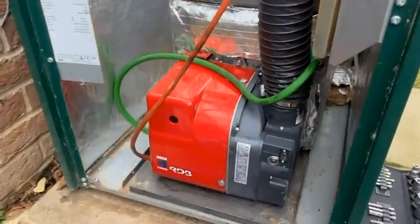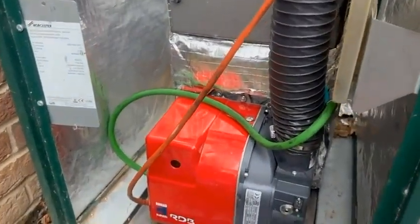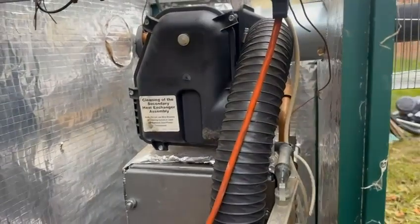Okay, it's back together. It's ready to rock and roll. I've just realised we need to take this cover off again to see the pump pressure. It's a 6060 ES nozzle in here, and it sits at about 125 psi. On Worcesters, it's extra critical.